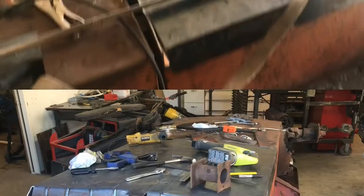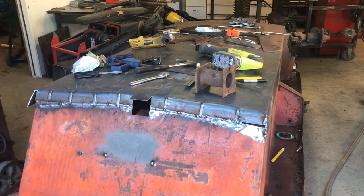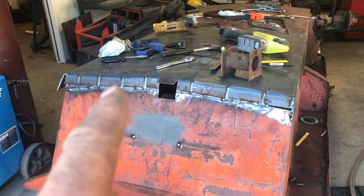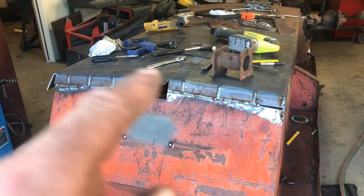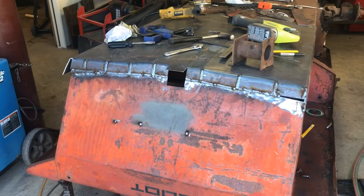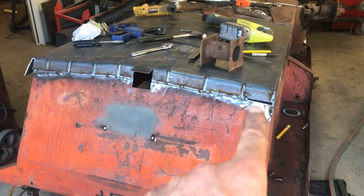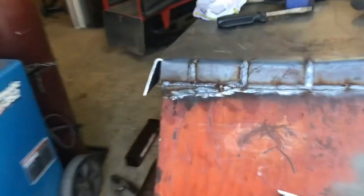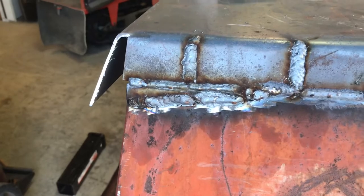You can just start welding it out. The coot project's coming along. You can see what I did here on the back — when I folded this over I've done little cuts because I couldn't get that to heat all the way across to get a good even bend. But it's going to be watertight by the time I get some rhino lining on there. It's off just a little bit on this end and that end. You can see what I've done here is I've just taken a little wedge piece and welded it in.